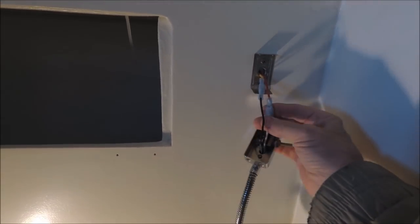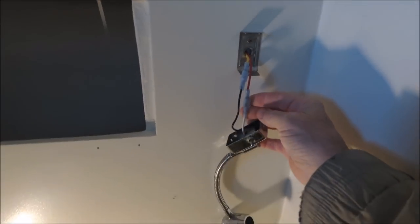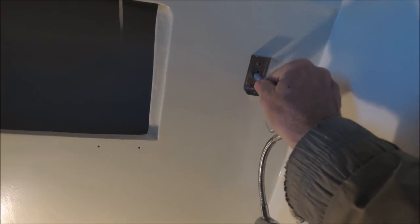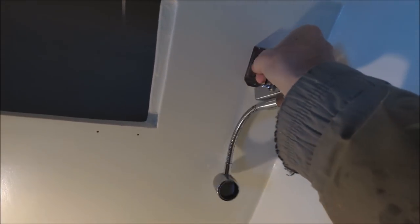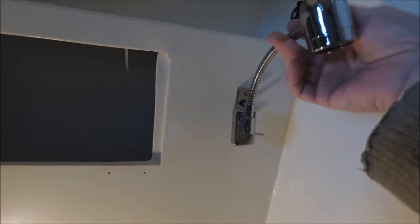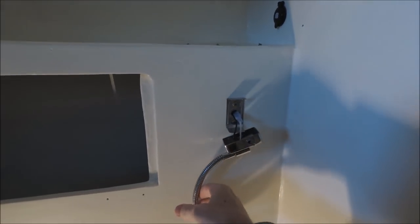Wherever possible on light fixtures I put them together with these quick disconnect fittings. I staggered the wire length so that they can be pushed through that hole together. That way with disconnects on them, you can remove them for replacement or testing easily.